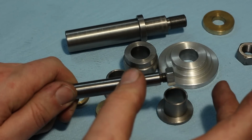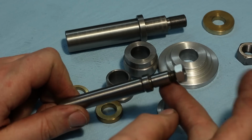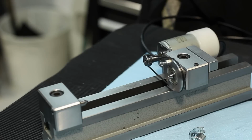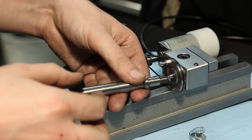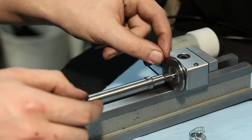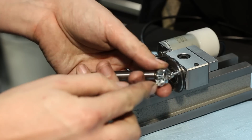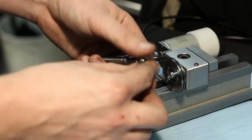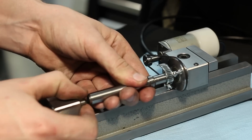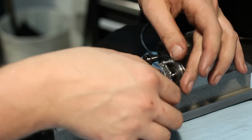So when I grind this, it will also be a very useful clamping tool for future use, and it's a good example of what can be done on the grinding jig. So let's go to a grinder and set it up. Okay, the workpiece will go between centers like this, but of course we need some way to drive it from the motor drive. And for that we use again a hose clamp, which just clamps on here and will give enough holding strength against our driving disc here to rotate the part, just like this.